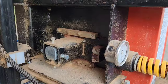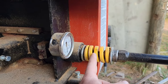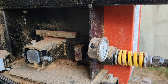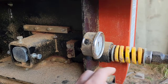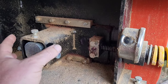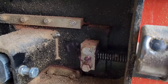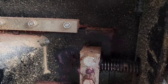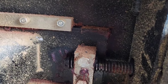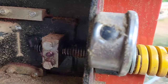If we look at the actual mechanism here, you have this big long handle with a screw and a spring — you definitely want a spring there, it gives you some play. If this was a hard fixed connection, there would be no play. That spring or screw goes through to this block right here, which is attached to an assembly that slides between these two bars. As we tighten up, you'll see things start to move, adding more and more pressure and tensioning up the blade.